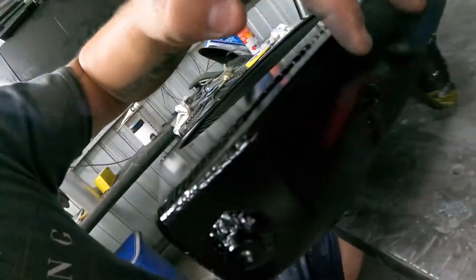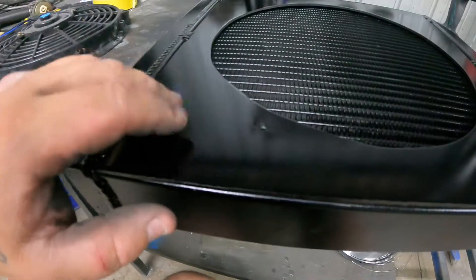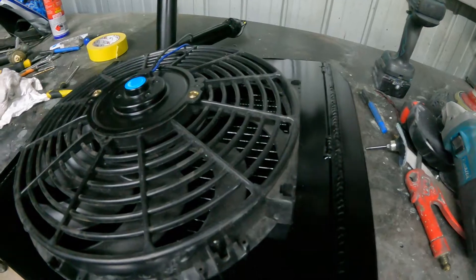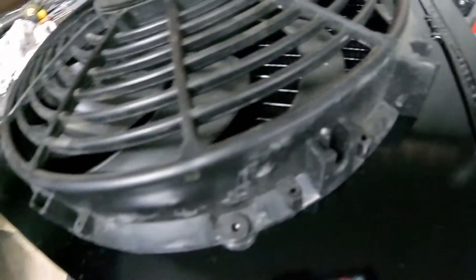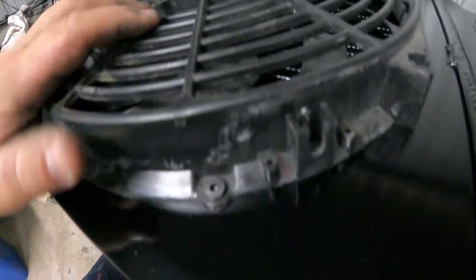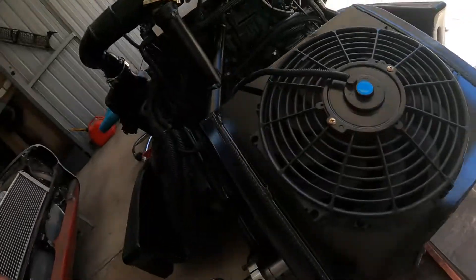I just repainted all these bits on the side that we had to touch up anyway. I didn't bother cleaning them up because just in case it started to leak again. So yeah, let's get the fan back on and get it back on the cart. Just four M4s I've got on there, a bit of Loctite tapped in, and it grabs great — it ain't going anywhere. So we can get this bad boy back on the cart now and yeah, pretty happy with how it's actually come up. Pressed all back on already.